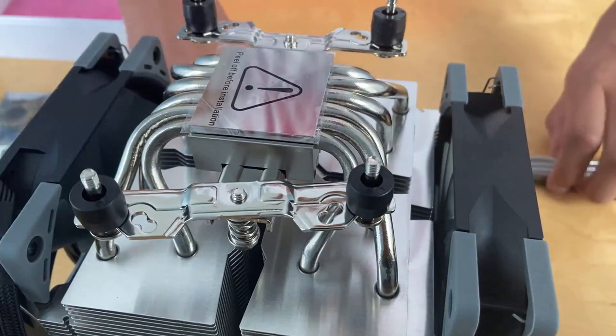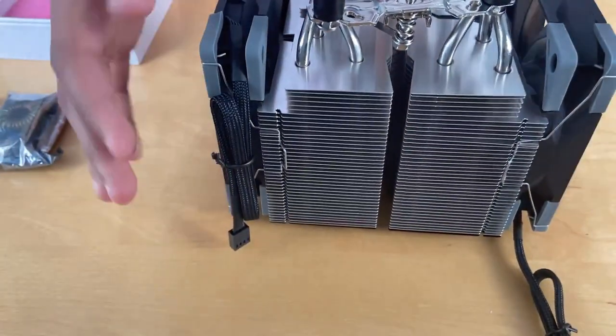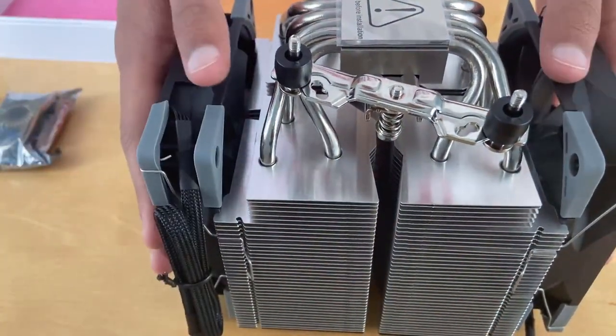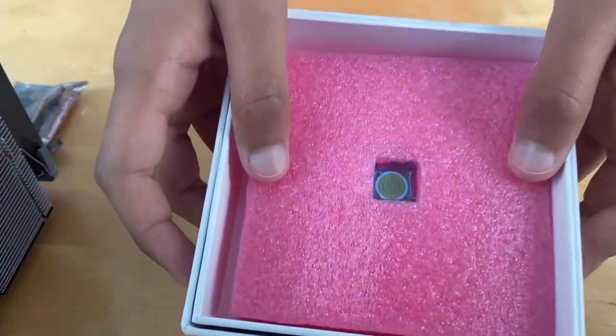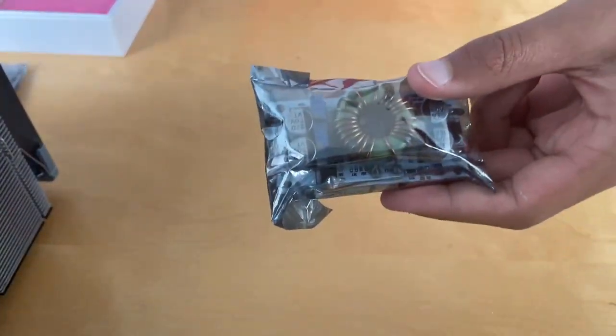Here we have a CPU heatsink or cooler, and you can see I've already attached two fans. This is one thing you can overspend a little bit on because you don't want your LED to blow up — it's pretty easy to blow up if you don't cool it properly. It needs to stay under 60 degrees Celsius.